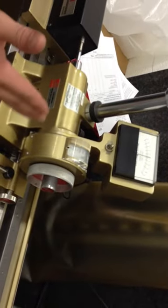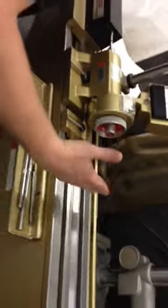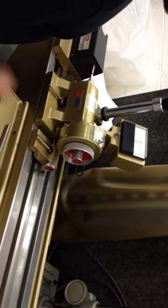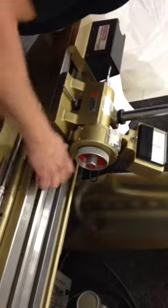And then you could back it off, move it down for length standards like this to check different sizes, or if you wanted to go inside 1 inch, then you just back it off and read it like a mic. There, you want to read this one right here first? Yeah, that'd be great. It was 6.5.